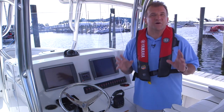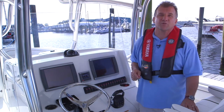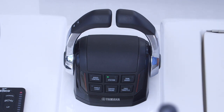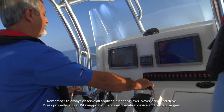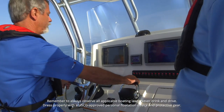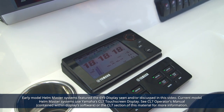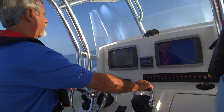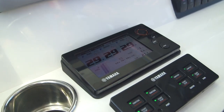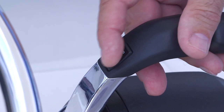One of the coolest parts of the Helm Master system is the Digital Electronic Control, or DEC. It's got a selection of functions that make operating your boat easier and more enjoyable. Helm Master Digital Electronic Controls are ergonomic and easy to operate, offering a host of operator convenience and control features. Throttle and shift functions are the same as with any binnacle control mount — handles are moved slightly forward to engage forward gear, and engine throttles are advanced as the handles are pushed forward. Engine RPM are automatically synchronized between the outboards through nearly all of the RPM range. A master engine trim button is located atop the port control handle, which trims all engines in or out simultaneously, and individual engine trim buttons are located near the fingertips on the forward side of the control assembly.